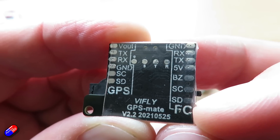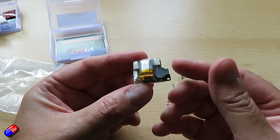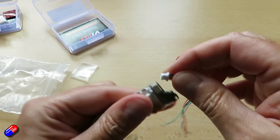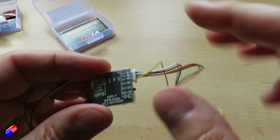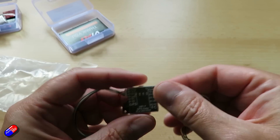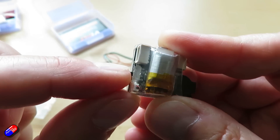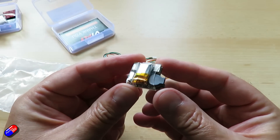You've also got the serial clock and serial data lines - the two pins for I2C. If you're using a GPS that doesn't have the compass wired up, which is how I tend to use it, you can just use the supplied cables to wire everything together and plug it all in - very easy to connect. If however you are using the compass in a quad, you'll need to use the solder pads, as not all of the cables are exposed, so you'll need to cut the harness back and do a little bit of soldering. There's one button on top to turn it on and off, and one on the side to select 3V, 3.3V, or 5V output to the GPS.